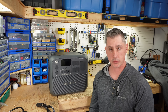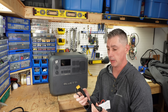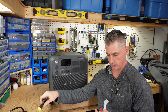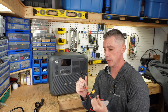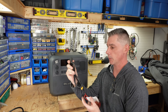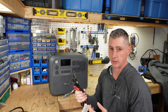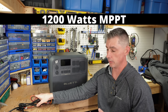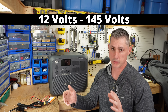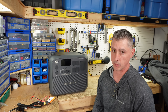Another way to charge the unit is through solar. They include a twist lock connection that goes into the unit into an XT60 — or actually this might be an XT90 — connection, over to another XT90 and then to your MC4 connectors. You connect the two of these, put this into the unit, and then hook these up to your solar panels. The max on the solar is going to be 1200 watts, with a voltage range between 12 volts up to 145 volts, so you can series connect multiple panels together and connect them directly to the AC200L.